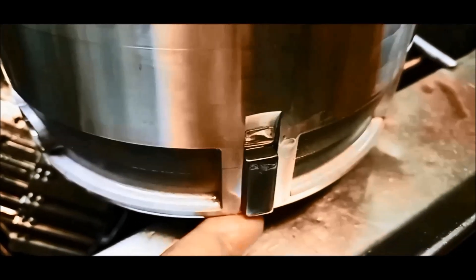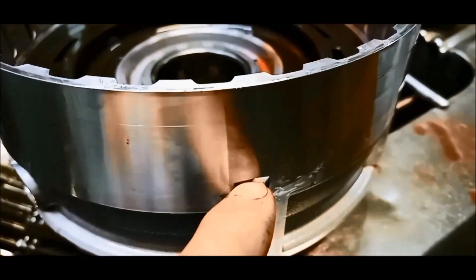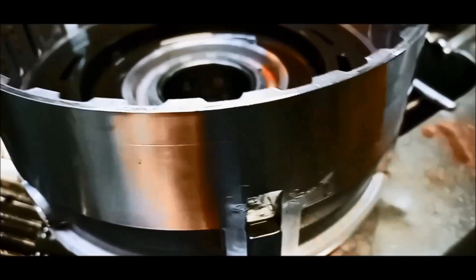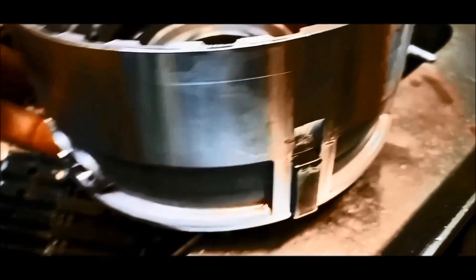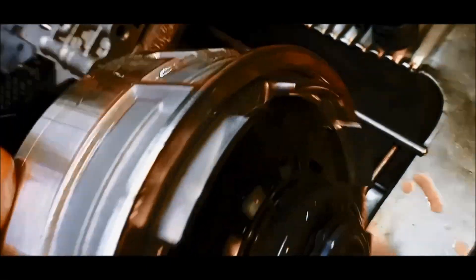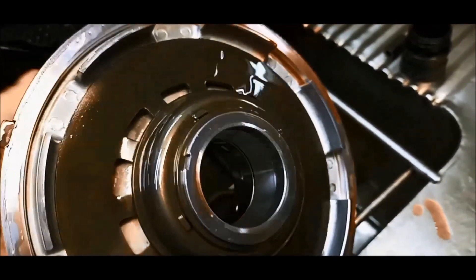There is a little locking pin there that just locks it so it can't wriggle around. You'll notice there's a little angled bit — as you push it in, it sort of pushes up tighter because it's pushing towards the case there, so that's why you've got to wriggle it a little bit to get it out. These diaphragm springs break occasionally, but again everything's looking very clean in there.